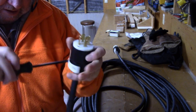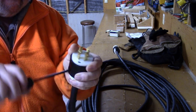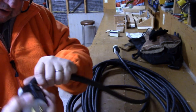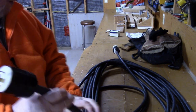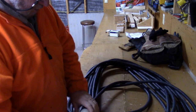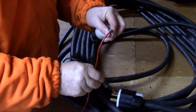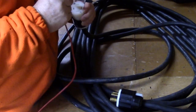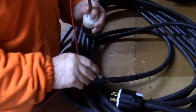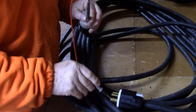I'm going to take a couple of turns on each side. There we go - that's just about as good as it gets. Now one little test I can do to make sure this is good is a continuity test with my meter. Ground to ground - that's good. You shouldn't get anything to the other three, and you don't. Then neutral - that's good, nothing on the other three. Then one hot side - nothing on the other three. And the other hot side - nothing on the other three.